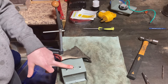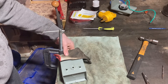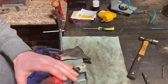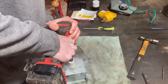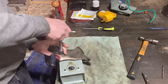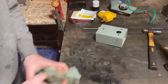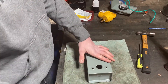The first time I got the pilot hole drilled, but then I moved the box too much when I actually went to start hole drilling. So I clamped it down to the table here — I've got a glove here so we don't mar the surface up too bad with the clamp. We're going to try this again. There's our hole. Don't forget to clamp your stuff down or it won't stay put when you start drilling with the hole saw bit.